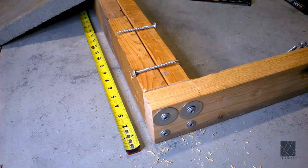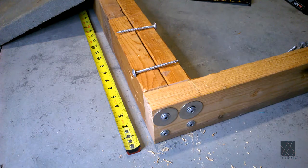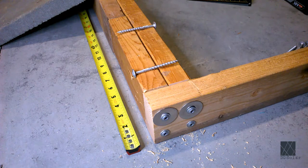And here's the detail for the corner. The corner is going to have a 9-inch long filler piece, which is right here. And because I don't really like this arrangement here, I'm being very careful, and I'm using a lot of fasteners. I'm using 4 6-inch structural screws, which go all the way into the material about this far. And I'm going to take 2 3-inchers and come in from 2 different directions on the outside. That's going to be tricky because I have to miss these fasteners here.